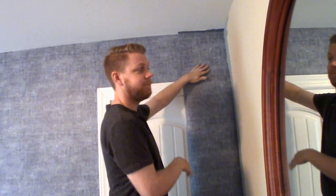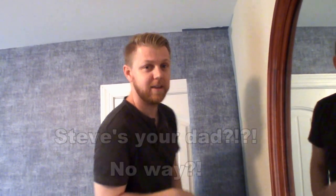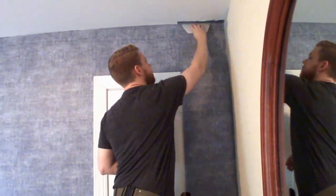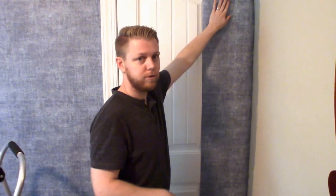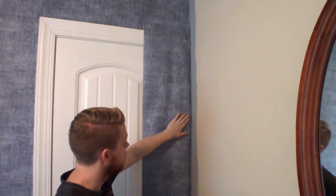A perk of having a Steve is he can tell you tricks like this. By the way, Steve is my dad — so I kind of grew up doing wallpaper, but that doesn't mean anybody else can't do this as well. Here's a trick my dad showed me: when you have a door casing that runs up close to the wall, this corner is going to be hard to trim. Make sure you have a sharp blade, unfold the paper all the way top to bottom, get your top situated, rest the edge of the paper right up against the wall, and stick the paper on your door casing all the way down.